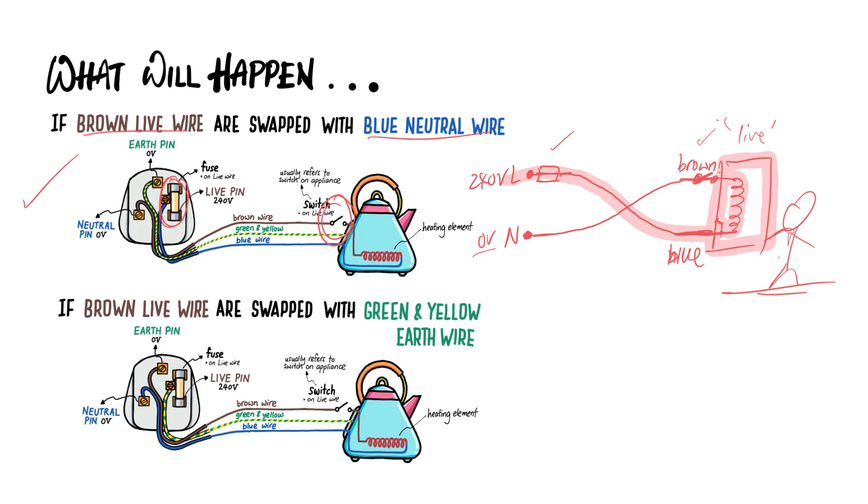For this case, it's a bit safer because you still have another safety feature — the earth wire. The earth wire is still connected properly: one end to the earth pin and the other end to the metal casing of the appliances, connected to ground at 0 volts. So when that happens, there will be a sudden short circuit — a current exceeding the fuse rating will flow through the metal casing, through the earth wire to the ground, because this path has low resistance. This will cause the fuse to melt and break the circuit.